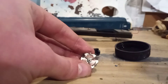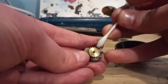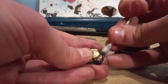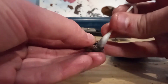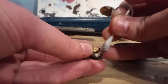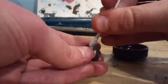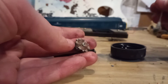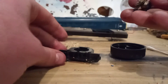Just give it a few turns until you feel it's satisfactory. You can also put some solvent on the copper wires too, in case they need a clean. Look at all that black I got off this in one go — if your model hasn't been serviced in a while you'll need a lot more than one cotton bud. This is why it's important to service your engines: they'll last longer and be more reliable. Bear in mind I don't have an instruction sheet — this is what I've learned from experience servicing these models. The motor is now satisfactory and should run really well.